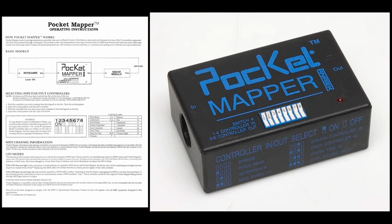Obviously, most of these controllers have an associated CC number. This little box uses a set of 8 dip switches. The first 4 dip switches, labeled 1 through 4, select the MIDI controller data type to remap. You can think of it as selecting the source MIDI controller type. The second 4 dip switches, labeled 5 through 8, select the destination MIDI controller type.